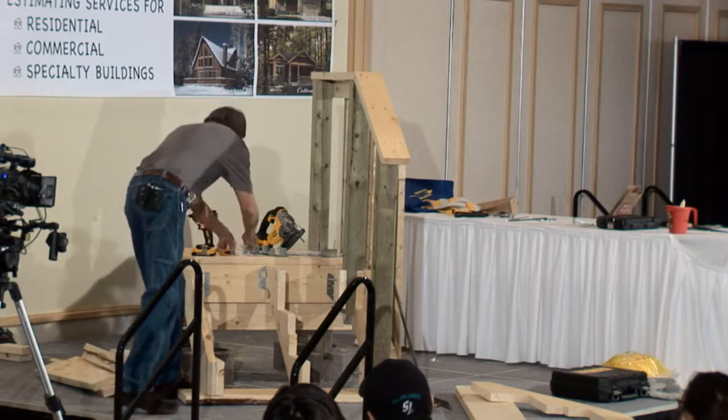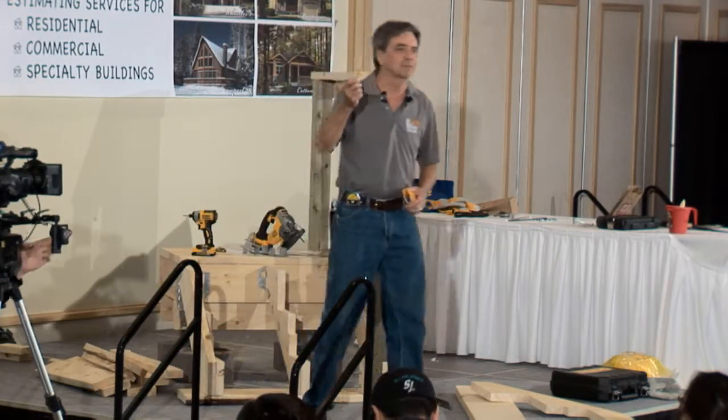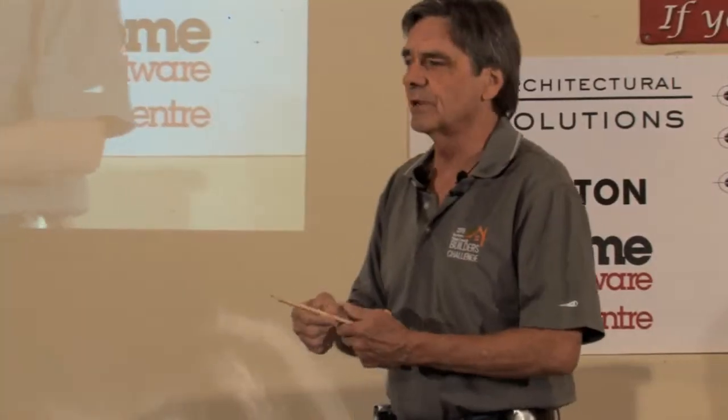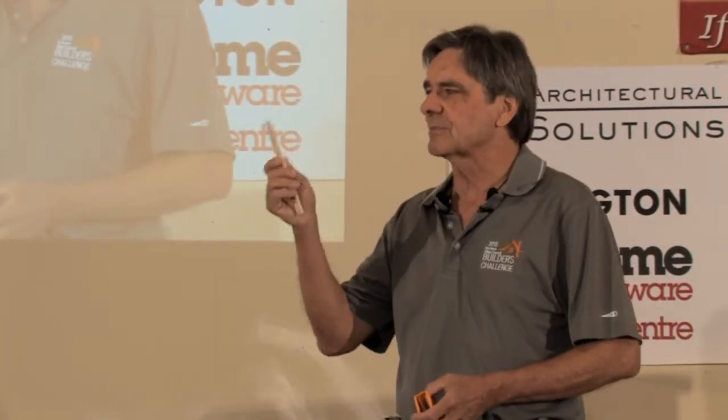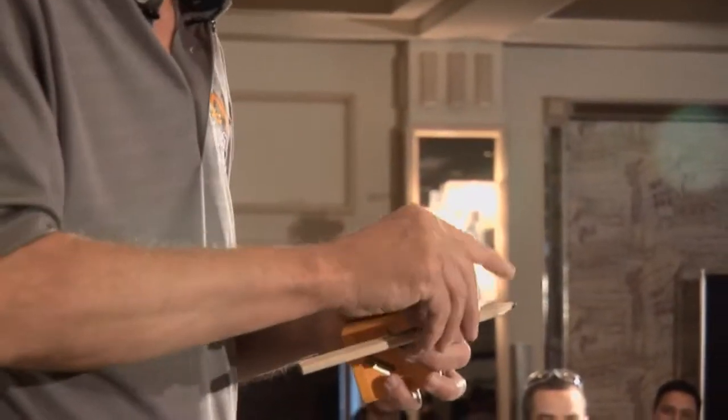Oh, one thing I'll mention to you is that we use flat carpenter's pencils, right? And normally we take a knife and sharpen them all up. We didn't bother to give you knives, so we'll keep them sharp for you. But the thing about these pencils is they sell little sharpeners that go around and sharpen them. If you've ever tried it, you know it doesn't work because the lead sticks out too far and it breaks. It's a real soft lead and it needs all the support.